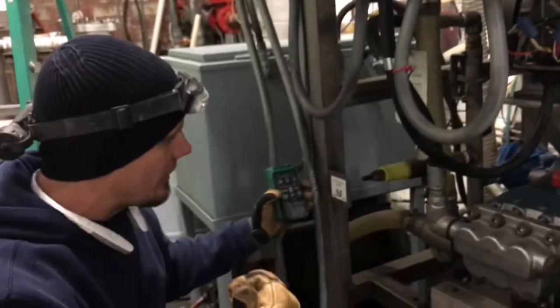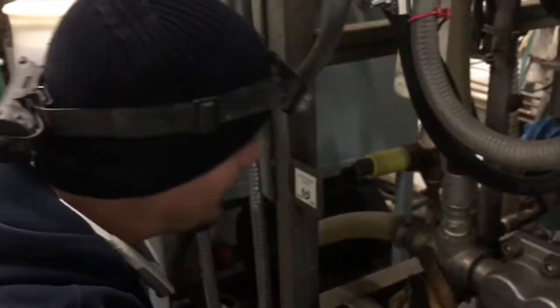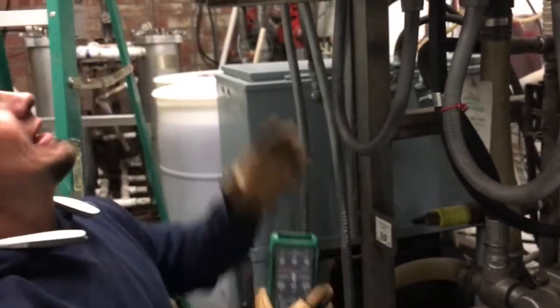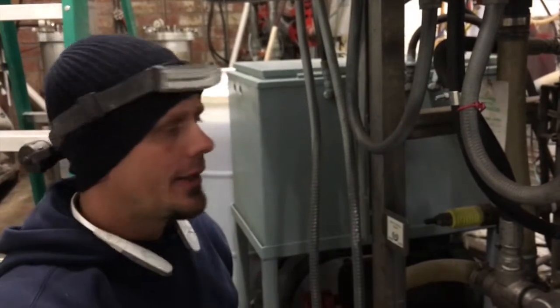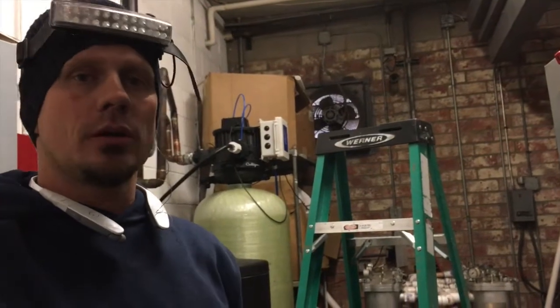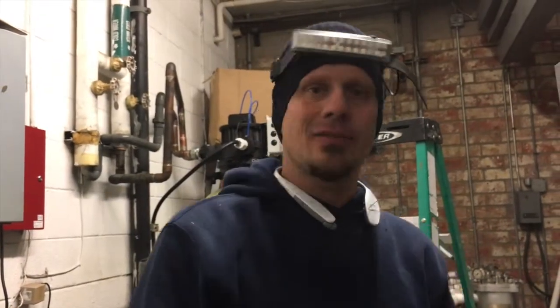So we're going to go ahead and hit that button and check its rotation. I already know that this is turning counterclockwise towards me. But I do need to verify with these guys here, which I don't think any of the maintenance guys know. My assumption is it does need to rotate this way, because the fluid's going to come this way in here and up and through. And then there's a shutoff valve for the water, so solutions will connect here. It basically is going to be sucking it — it's a reclaimed system pump. So I'm a little bit blind here because they didn't tell me a lot; they just said come wire it. Anyways guys, thanks for joining us. Hopefully that'll help you out a little bit about the phase rotation meter, as well as how to wire up the connections on a high voltage versus low voltage on a three-phase pump that's 20A. The video was done in December 2017. Thanks guys.